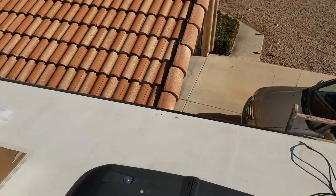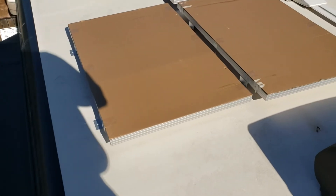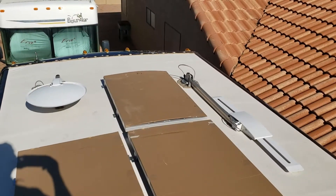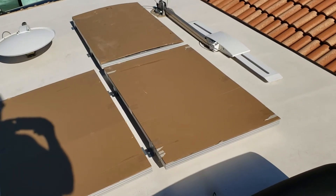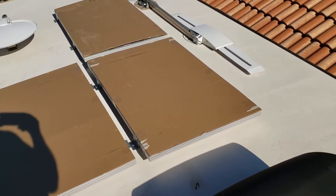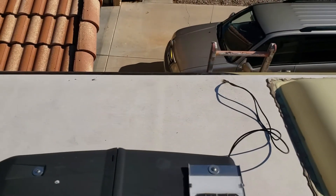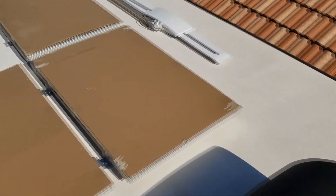We hoisted the panels up and after putting the feet on them, you can see the zippy feet here. We're going to drill a pilot hole through into the rib to make sure it's a metal rib. I'm going to bring all the cables underneath the center panel and then to one side, where I'll tie-wrap them to the feet so the fuse will be accessible from the right-hand side. I'll probably run the cables alongside the air conditioner and up under the panels, then put a four-inch-wide tape over the cables as they go up under the panels.